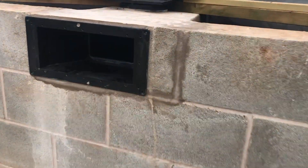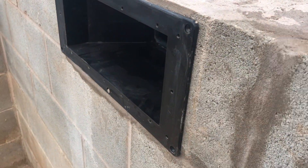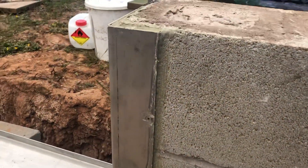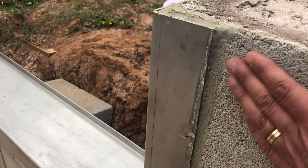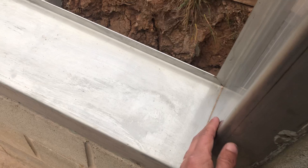A skimmer you can pull back flush to the wall or leave it slightly proud, work around whatever you leave. Window — make sure that's well in. I'm going to foam up to this one and we're going to be glassing over the aluminium frame.